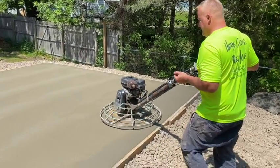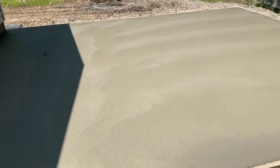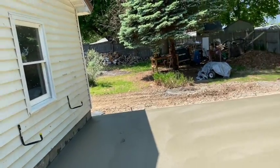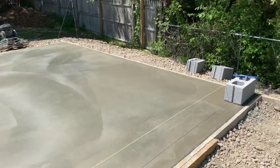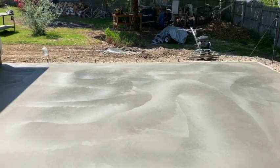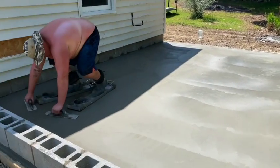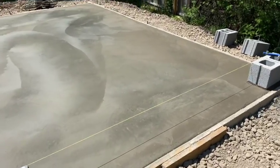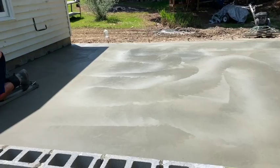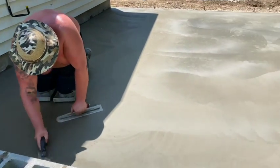She's cooking - and roll it. Okay guys, it's 2:17. We poured this thing starting around 11:17 - about the same time. This section is completely done. The only spot that isn't done is where Biscuit is in the shade right there, so he's finishing that. We already started laying some blocks. I had to stop laying blocks because that floor was just toasting right up, so Biscuit's going to hit it again with the mag. We're just going to have to blend that section into the burnt section - we took the machine right off.